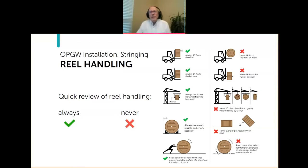The little drawings depict a reel with wood lagging. Forklift drivers often think the wood lagging can support the full weight of the reel — that is absolutely, totally incorrect. The wood lagging is really there just to protect from impact and environmental damage. It cannot support the full weight of a reel. If the forks don't go flange to flange and you try to lift the reel, the wood lagging will break, that could damage the cable, and then everybody has a bad day.